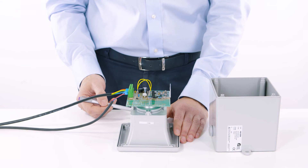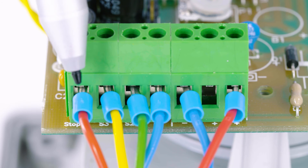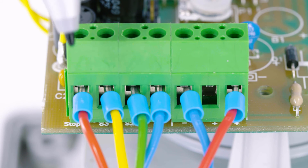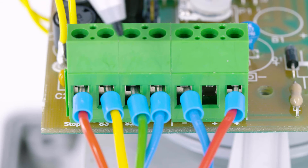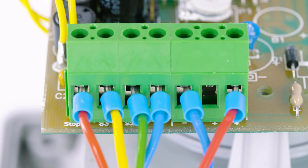The Hootronic sounder has the facility to replicate the tail off traditionally associated with the tones generated by electromechanical devices. To achieve that, just cable into the terminal marked 'stop' on the terminal connector. The user can activate and deactivate the sounder by switching the connection between the stop wire and the negative supply line whilst the unit is powered. To achieve the tail off sound, the unit must remain powered.